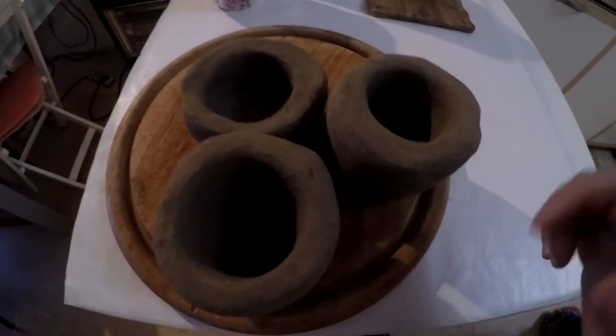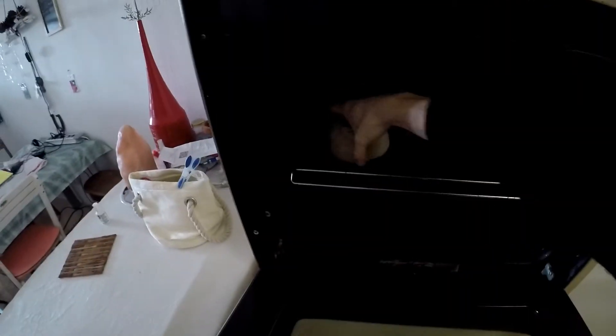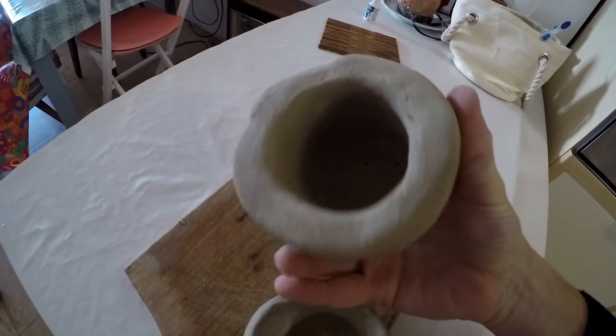I placed them in the oven at 50 degrees Celsius for the duration of several hours so I could cure the clay and prepare it for firing. After the low temperature drying cycle, the crucibles became very pale and as all water had evaporated they became warm to the touch at room temperature — they were not endothermic anymore.